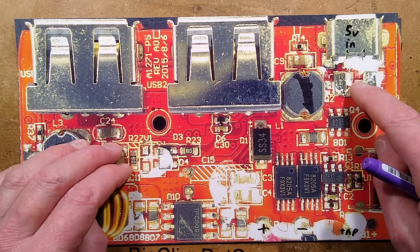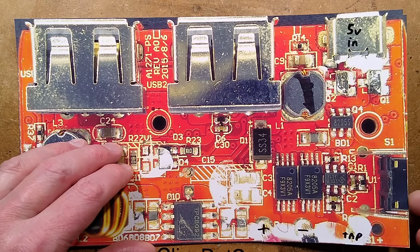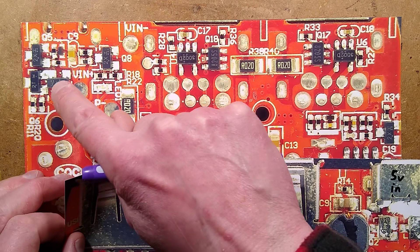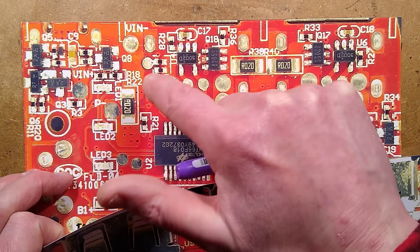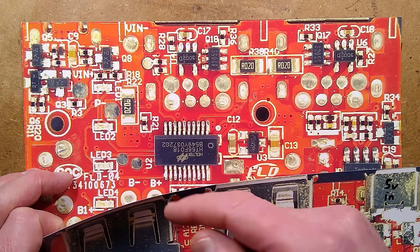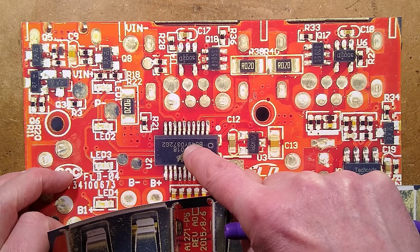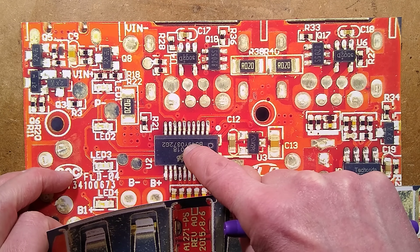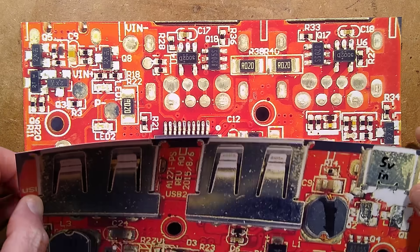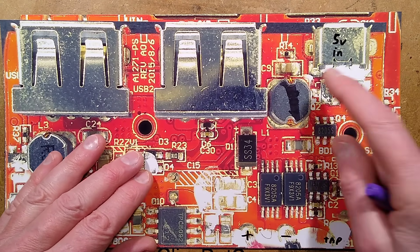I was expecting a standard boost chip but there isn't one. Looking at the back of the circuit board around the micro USB port area, it's got loads of discrete transistors — it honestly looks as though they've made a discrete boost regulator. There is a current sense resistor the microcontroller is probably using to monitor incoming current, and there's no dedicated chip for the boost — just that discrete circuitry and the MOSFETs switching the inductor. Strange.